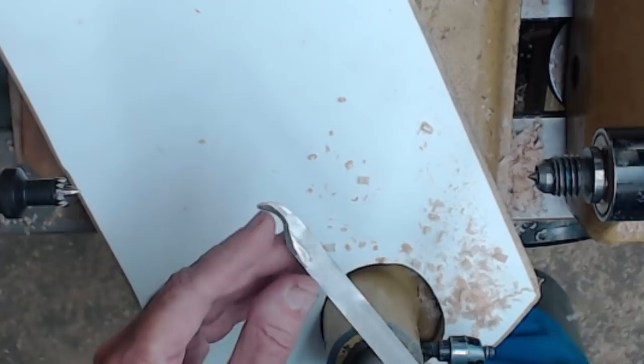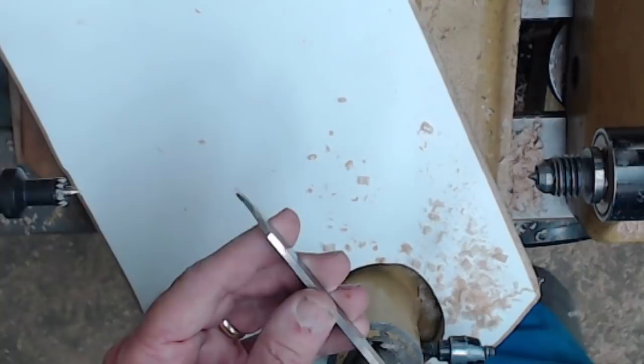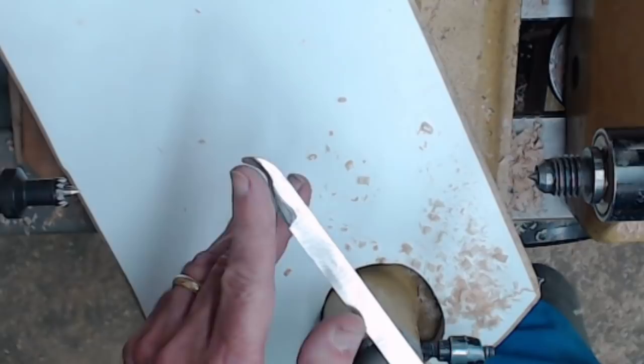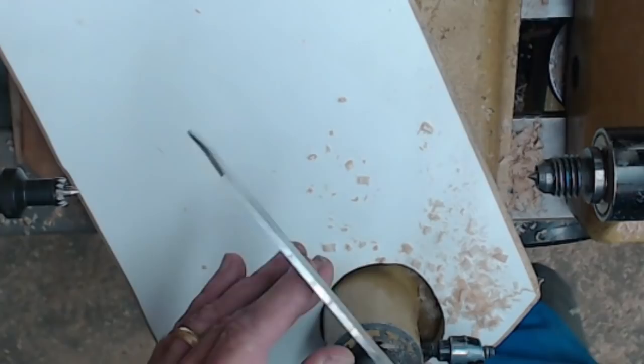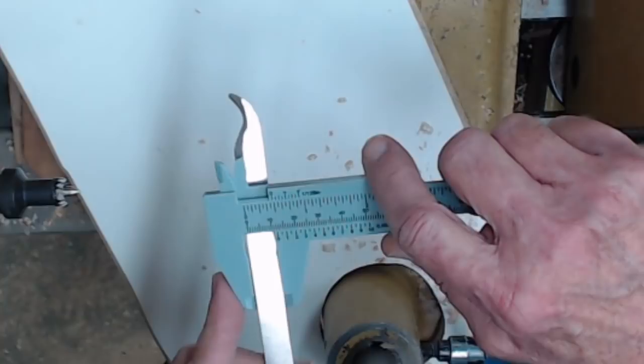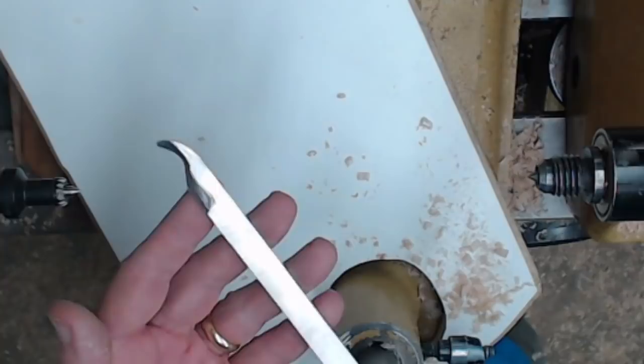This one is ground very similar to a crown tool — you have a cove and a flat cutter on the tip. There's the side profile: it doesn't come to a complete point, which makes it a little easier to shape, and then you just grind this on your grinding wheel. This is made out of a piece of high-speed steel that's about an eighth of an inch thick — you can find it in the show notes on my Amazon. This one is just a hair less than a half an inch. Put it in some kind of handle — I drill a hole the width of the flat bar and glue it in with epoxy, with a half dowel that's been ground flat on a sander, fit and pounded in on each side. This is a simple handle made out of PVC, but you can make it out of ordinary solid wood.